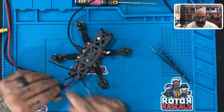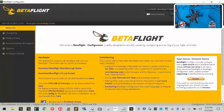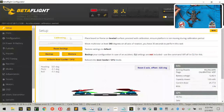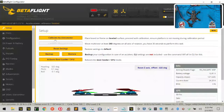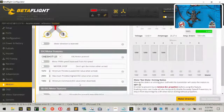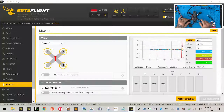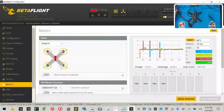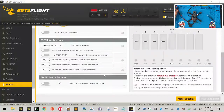Click Connect and go to the Motors tab. Notice we no longer get the motor protocol error because we fixed it. Look at the motor diagram — it shows motors 1, 2, 3, and 4. The arrows indicate the direction each motor should spin. Motors 1 and 4 spin clockwise, and motors 2 and 3 spin counterclockwise. We need to verify that each motor is actually spinning in the correct direction.